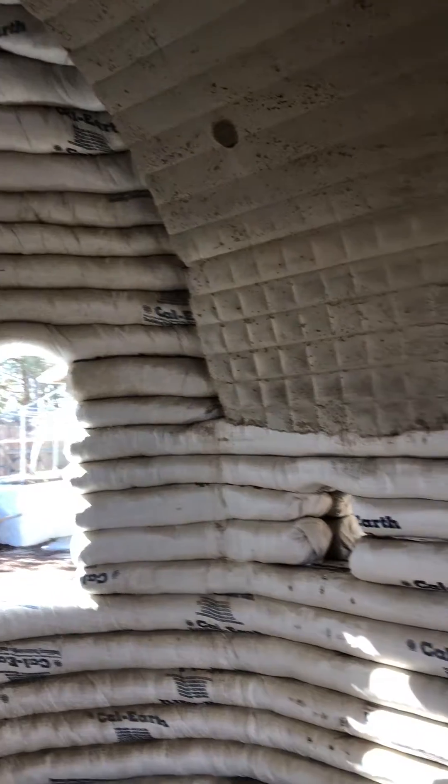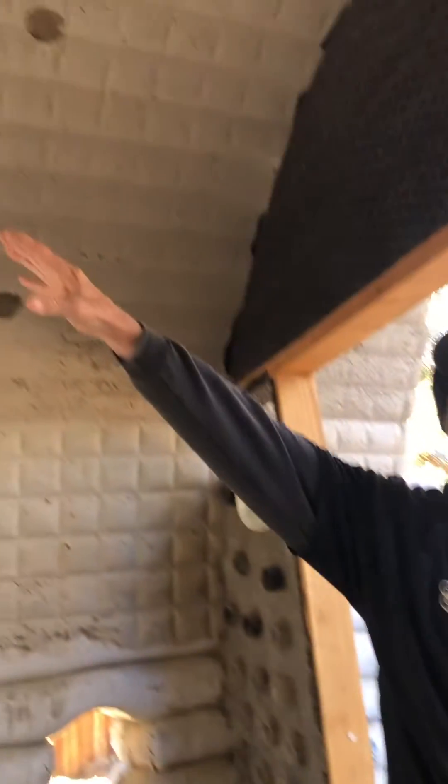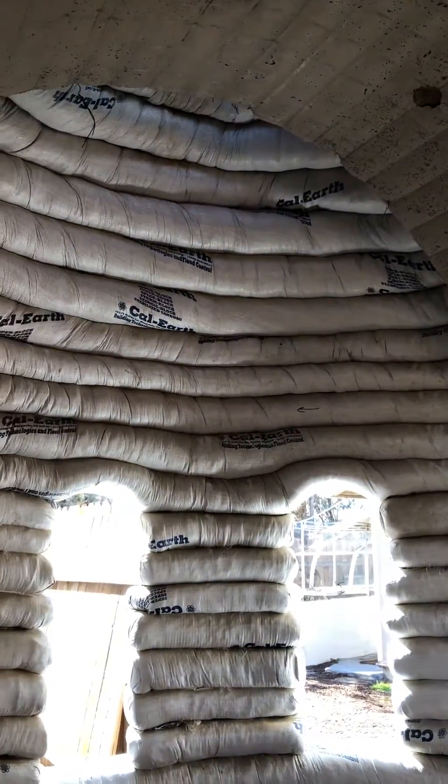So what was the reasoning why you guys decided to put the dome on the end instead of just go to a flat wall like we do typically on the vaults? The vault is one section. We actually put a dome, a Lancet Arch dome on the end to close it off and do a reverse suction of air so that all the heat that will be generated from this room will actually come in and go out the way we decide to make it happen. Because we're going to be doing the firing in here.